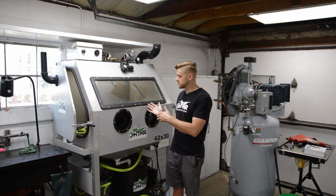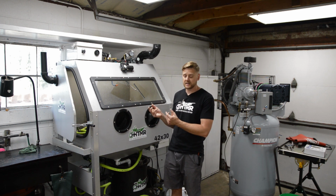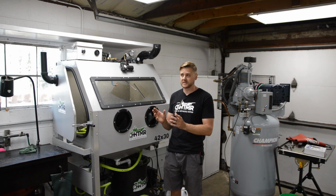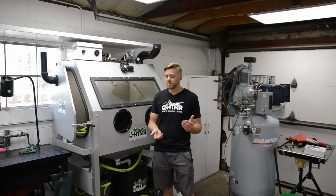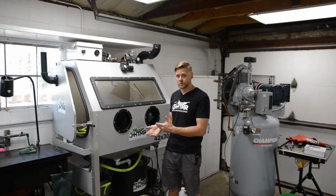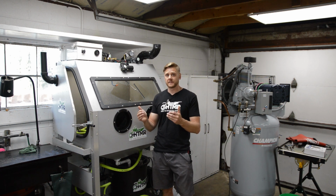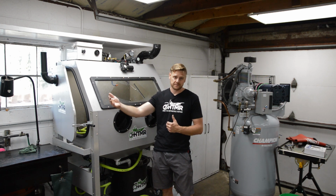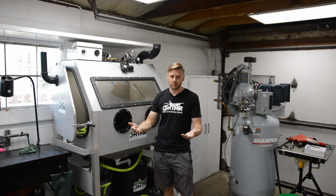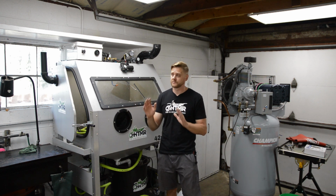Now, by all means, I usually throw a larger gun in when I can. If I'm doing a small part, 10, 15 minutes of blasting, I'll throw in a bigger gun just to get it done quicker. But if I'm going to be blasting here for an hour or two, I'm probably going to select a gun that's a little less than the CFM of the compressor so it can stop and start and keep up with the demand. Okay, so that's one way of doing it.